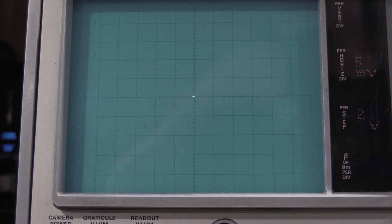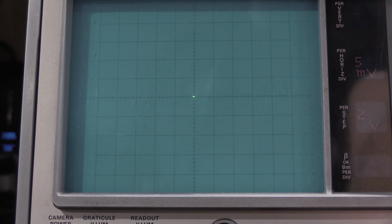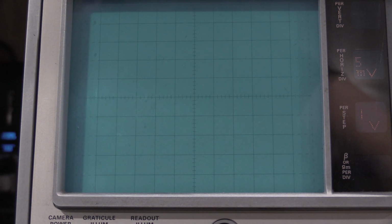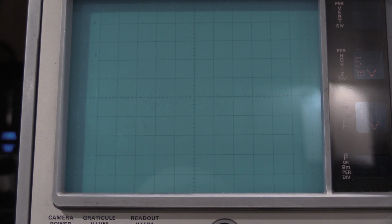Now we need to do the step amplifier gain, which is number of steps to 10. Amplitude is a volt. Step family is rep. Polarity invert is released. Function is step gen. Step generator is 0.05